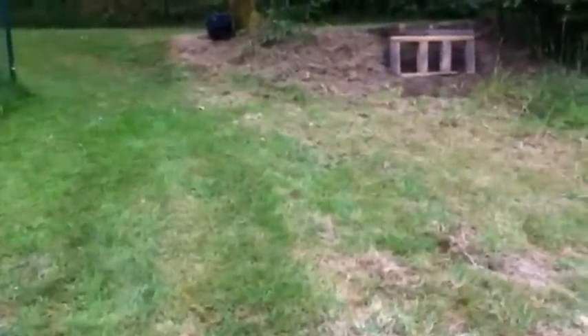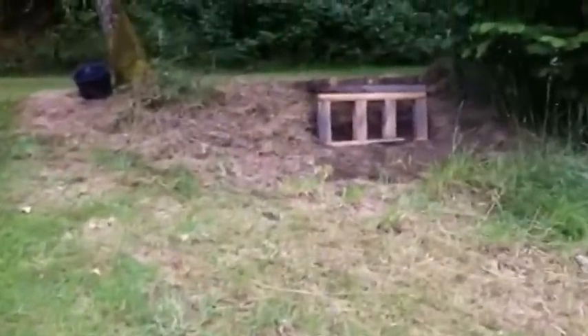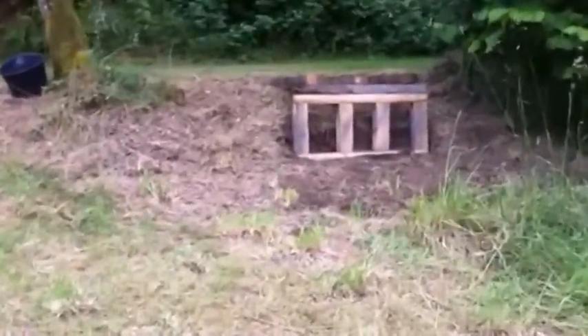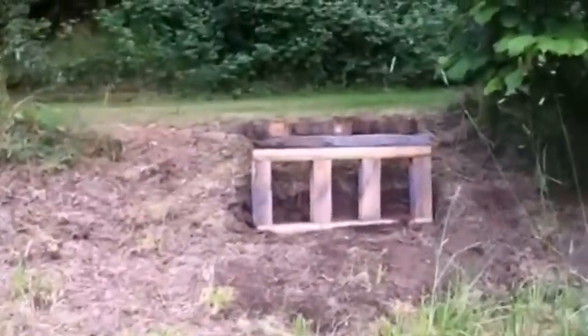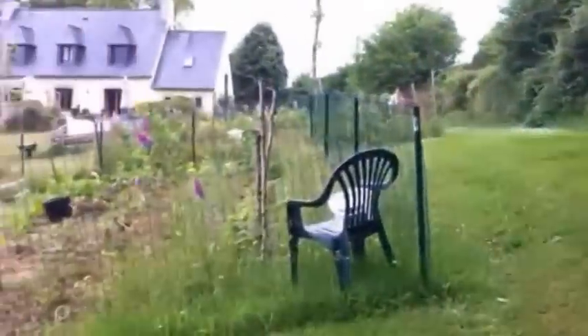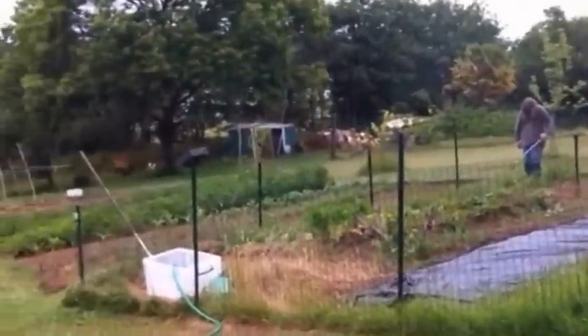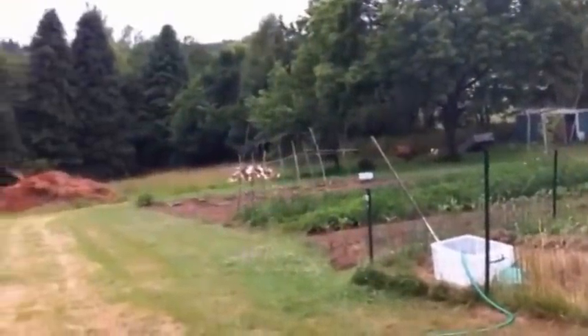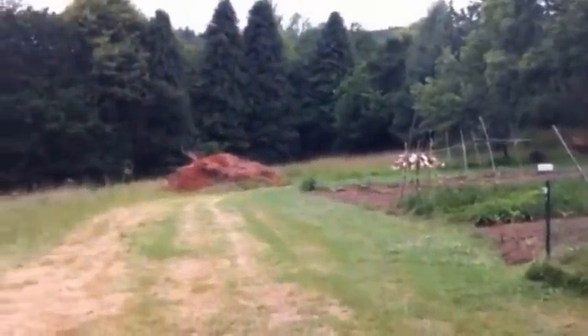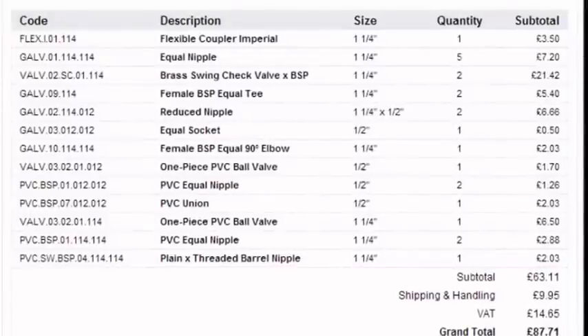Although I'm obviously happy that I've got the water up to this height, I really need to raise it about another 10 feet. I've built a stand in preparation for this at the very top of the garden where I'm going to put a 1,000 liter water tank, and then I should be able to supply my garden by gravity from this. However, this is going to take a little more thought — the length of the drive pipe, perhaps a different expansion tank — all of this will be in the next video.